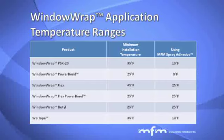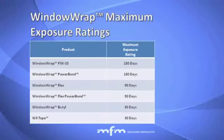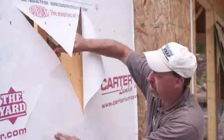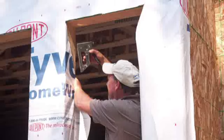Please refer to the following charts for proper application temperature ranges and product exposure ratings when installing Window Wrap. If the structure is utilizing house wrap, you will need to cut a traditional X pattern in the window opening. Fold both side jam pieces inside the structure and staple securely.